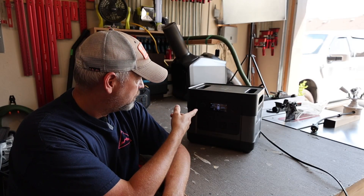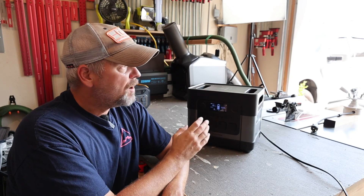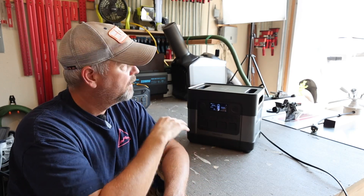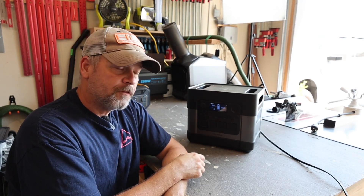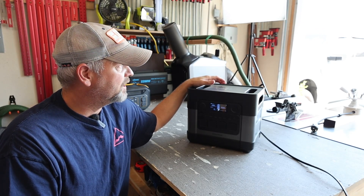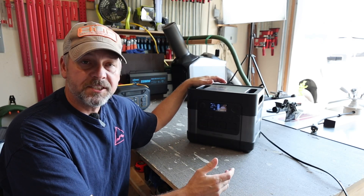We're up to 400 watts now, back down to 390, and sitting around 340 watts. I like this panel because it's very lightweight for a 600 watt panel. It's going to be tough to get 600 watts even on a perfect day, but you still have the ability to get more wattage than the AllPowers 400 watt panel — even though you can't adjust the angle or do anything other than lay it flat or hang it. Getting up to 400 watts today in these conditions is something I'll take all day, because I wouldn't get 275 to 300 watts off the 400 watt panel.